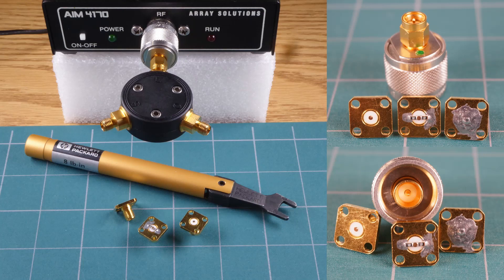I have an HP8753 analyzer which goes to three gigahertz, and I have a near-new set of calibration loads for that analyzer. The SMA male calibration load is shown here — even though it has female connectors, they call it the male load because it connects to a male connector. I have both the male and female three-and-a-half millimeter loads, which are compatible with SMA connectors. I've had them checked and they are good.